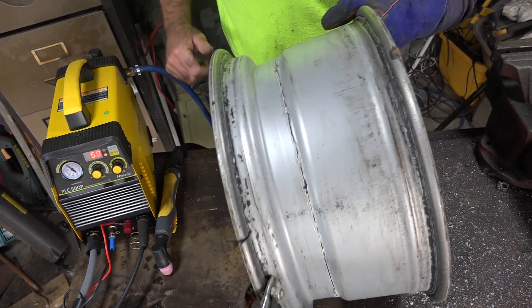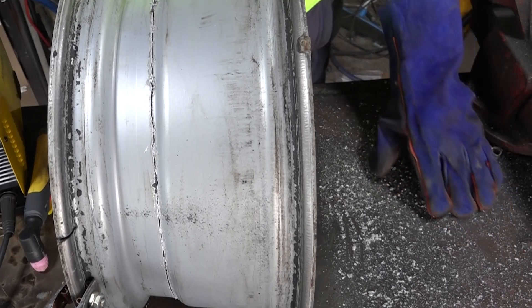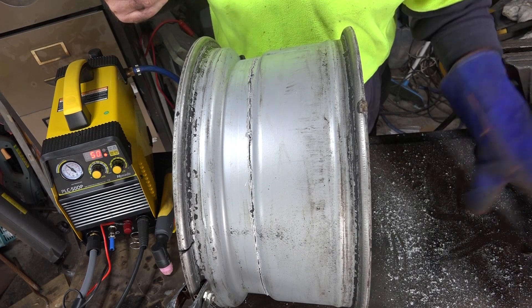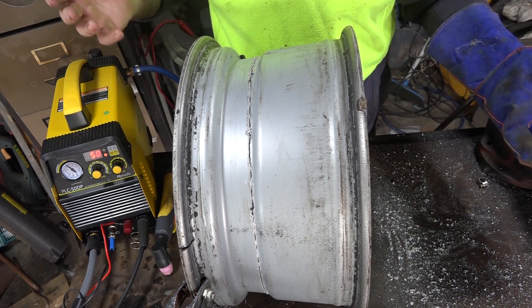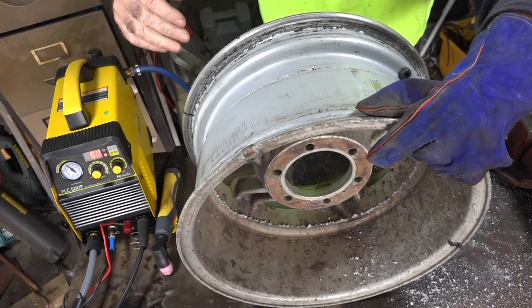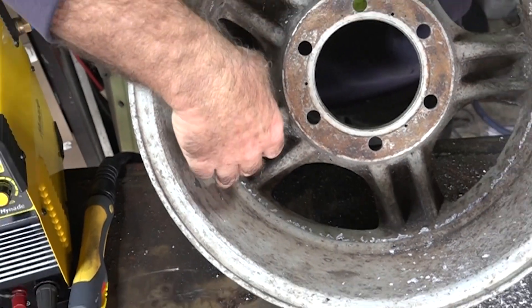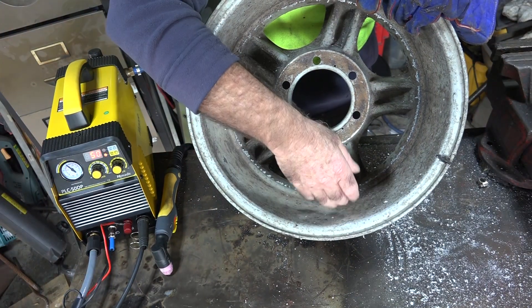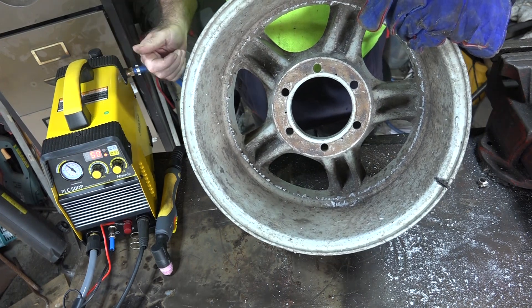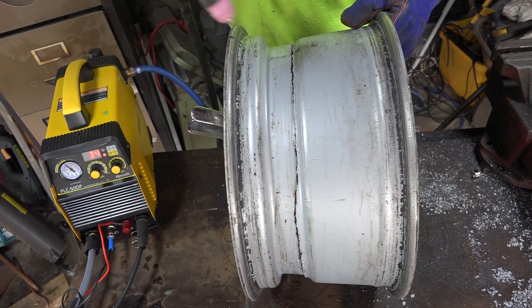All right, I've gone all the way around and I'll show you the inside. Can you see all this stuff that's coming off that cut? It's absolutely incredible — it's as if you're using a saw. All sorts of stuff coming off there, all sorts of dust. Quite unbelievable really. If I show you the inside — can you see? It's not a clean cut. It's all got sort of drossy stuff coming through it. See all the powder? It's cut in sort of a weird way. Aluminum is totally different to cut than what sheet steel is.